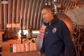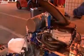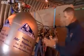To do that and to spin that pump takes 800 horsepower. Hence, one of our 3 engines is a Cosworth Formula 1 engine just to turn the pump motor. This, in 20 seconds, will pump a ton of hydrogen peroxide into the rocket at over 1,000 pounds per square inch. While that engine is running flat out, it is pumping through this blue tube, and it will then pump the hydrogen peroxide for the test rig here into the hybrid rocket.